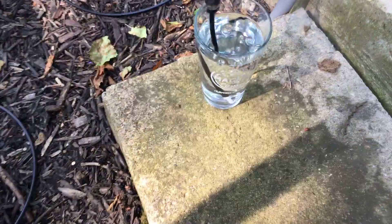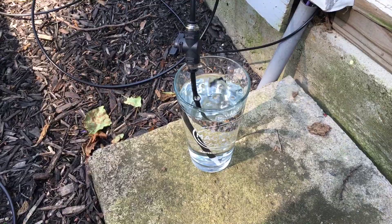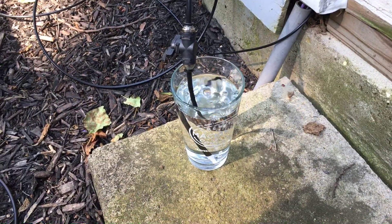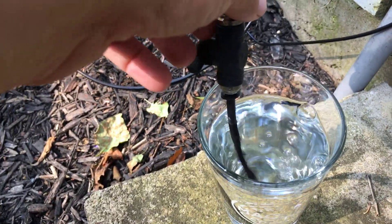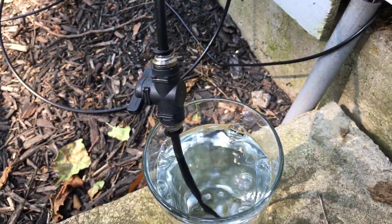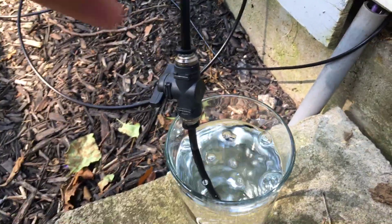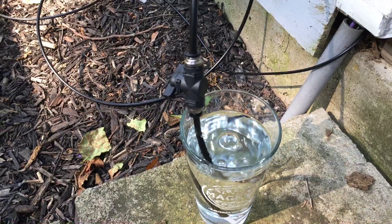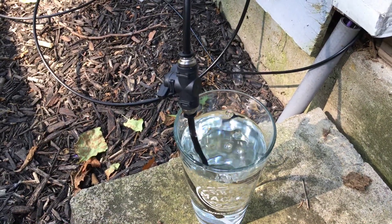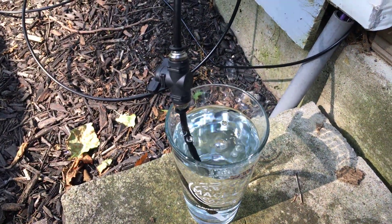The real problem I had is the CO2. Running electricity out to these isn't too hard, but the CO2 is a trick because you need the valves if you have multiple traps on one system. If you have one valve and one trap it's no big deal, but I've got a tank in the basement and this is running out almost 100 feet already. So I had to find a valve online that could handle pressure and keep the CO2 from leaking around the valve itself. This one's designed for truck air ride suspensions. Basically the tubing they sold me is CO2 tubing — I think it's quarter-inch RODI tubing — and it fits perfectly with this particular truck suspension valve. I'll post a link to where I got that.